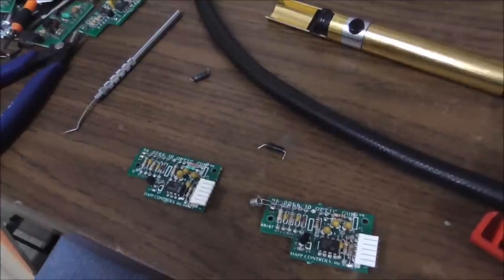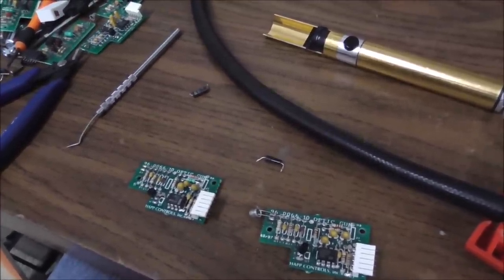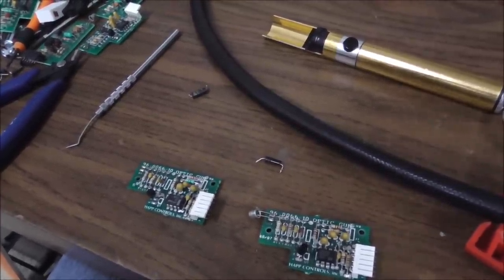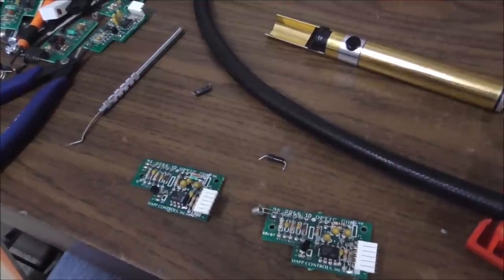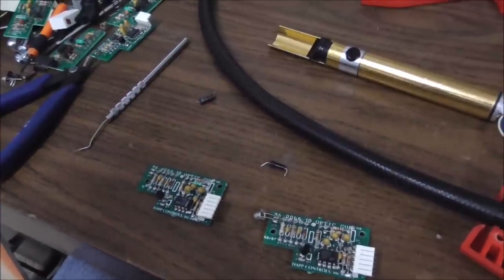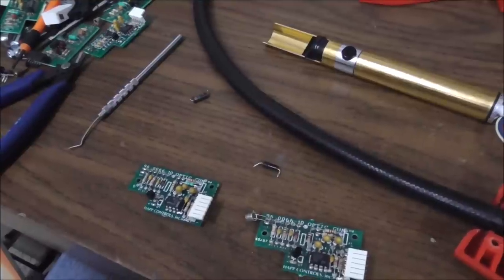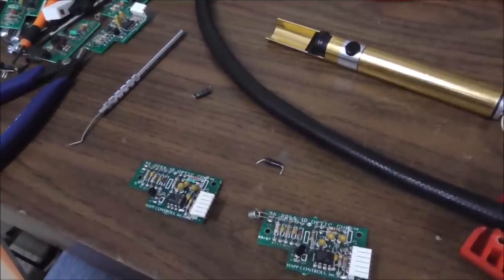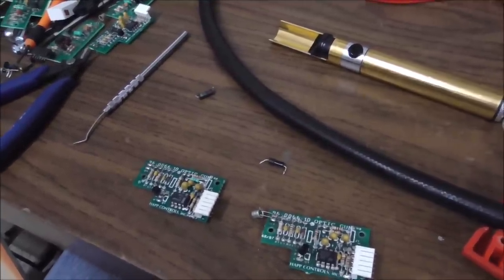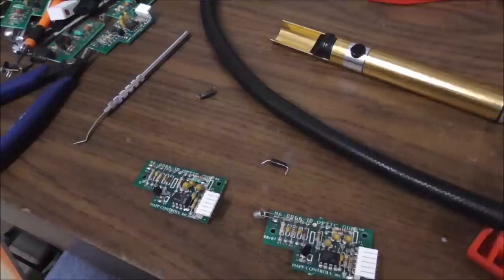Now, there's a few exceptions to that. I've seen it where, if it's next to a big coil, sometimes, I guess because maybe my meter can't send enough voltage to test it, I've seen a few times where that's not true. You take it out of circuit and it's fine, but in circuit it reads higher than the actual value of the resistor. So every once in a while you run into a situation like that, but a lot of times you can just check them in circuit.